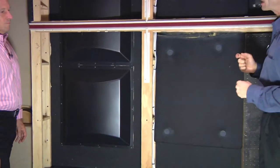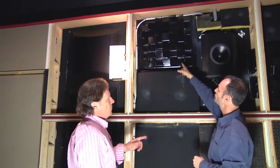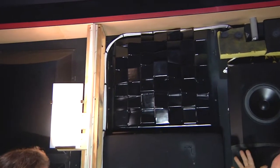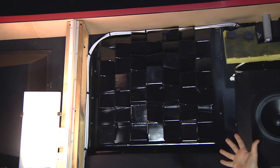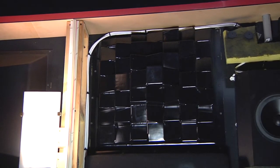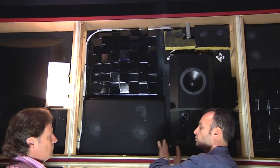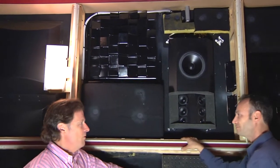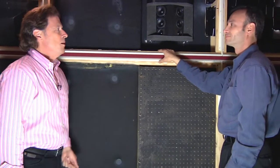In addition to the 2D panels, we also have some 3D diffuser panels. 3D diffuser panels take the sound vector that hits them and redistributes them hemispherically in a circular form. What that does is give you a sensation of envelopment out of the surround speakers and out of the back quarters of the room. We typically tend to put those towards the back of the room and the 2Ds towards the front. And over here you have a bass trap — we've seen those on the lateral walls and also in the floors.